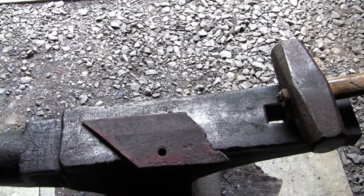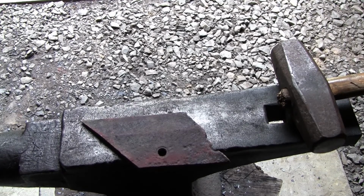Again, here's a piece of tractor blade, and a couple weeks ago I heat treated it to take some of the hardness out, so it could be re-heat treated. But the amount of carbon in this steel is considerable, and I can tell just because of what it was used for. So I'm going to fold that into the three-layer billet that I made another week, that was a full tractor blade wrapped around a very large chunk of wrought iron.